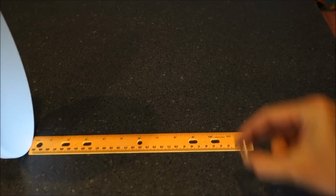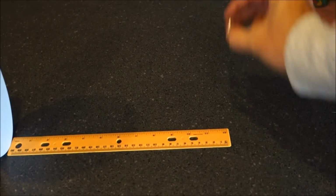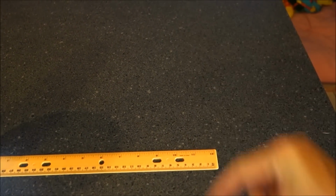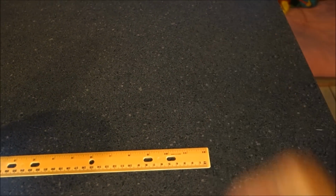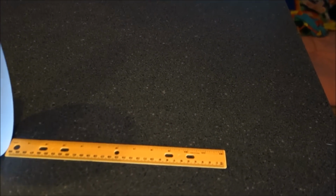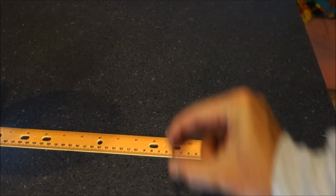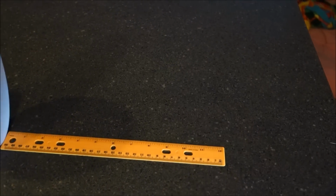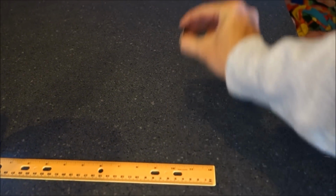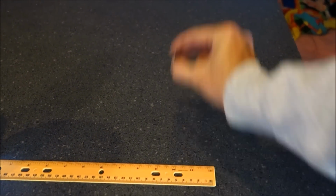Yeah, look at that now. We're clear out at 11, 12 inches. So nickel, oh yeah, 11, 12. So we're air testing out at a foot now, okay? Zinc penny, not so much, about 10 inches it starts to come in. Copper penny really starts to come in about 9, 9.5 on the copper.